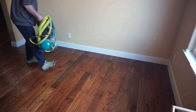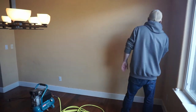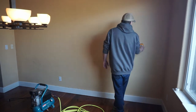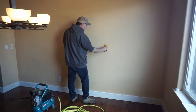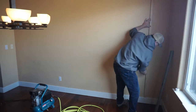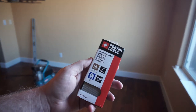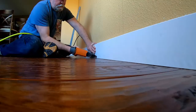You're going to need a brad nailer of some kind, whether it's pneumatic or one of those battery powered hand nailers — get used to using it, there are a lot of brad nails. Make sure you mark all the studs on your wall top to bottom so that you can find them on all the trim pieces that you put up. I used 18 gauge 2 inch brad nails — that would reach all the way through the trim, through the drywall, and into the studs.